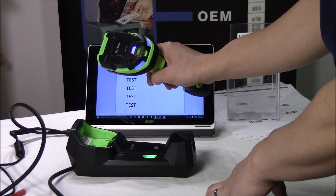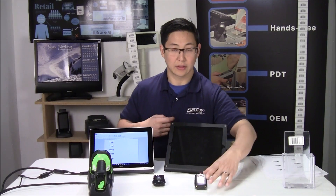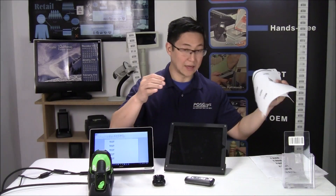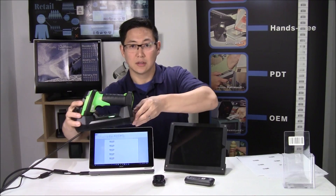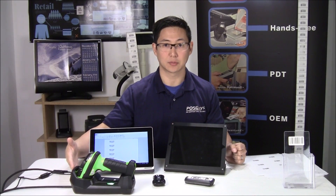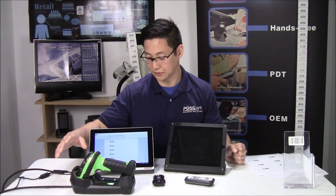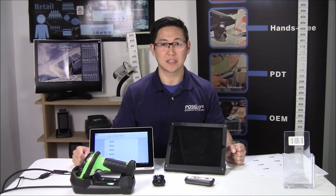That's our basic rundown on Bluetooth scanners and pairing with iOS, Windows, and Android. Generally, the companion scanners can work with anything where you have a Bluetooth device. You will need the barcode sheet in most cases that has the pin codes on it, so you need to download that — we'll put a link in the description of this video. If you're using a Cradle device, generally you just need a USB connection. With regular Mac desktops, you can use them as well — just plug into the USB port. If you get a notification that an unknown USB device is found, just click cancel, and then it'll work like a keyboard wedge device. To download the pairing guides or for more videos, please visit us at POSGuides.com. Thank you.